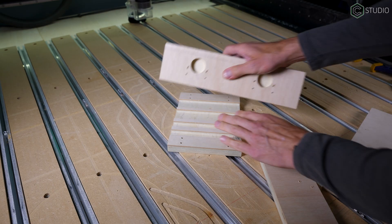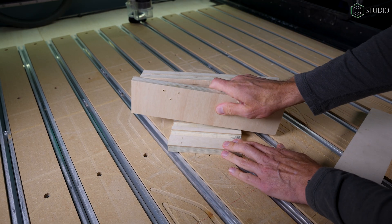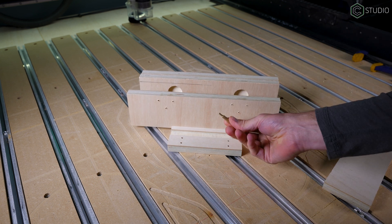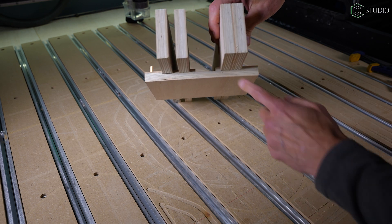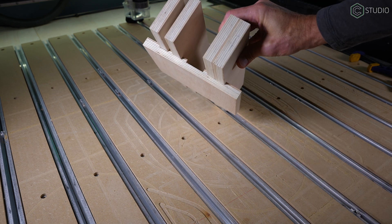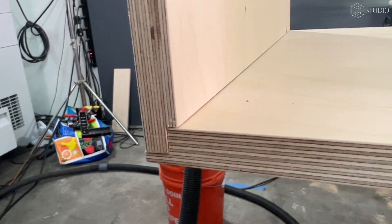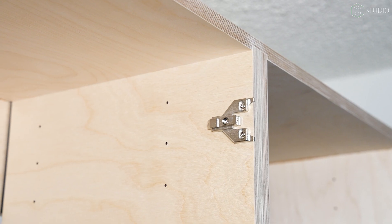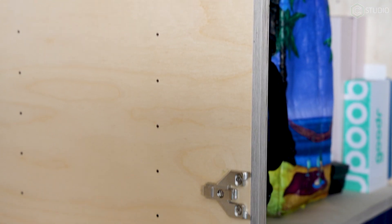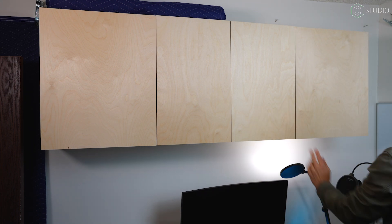Additional advice for version one: make a test rig. There's no need to waste a ton of wood — just worry about testing the interfaces of your design first. For this one, I thought about my dividers, putting them on a quarter-inch inset to provide stability and exact placement. I had to consider how my ends would interface with the bottoms and tops to form the overall box. I also had to figure out how to pre-position the clips as well as the hinges, along with all the mounting holes, so that when I pull the piece out of the machine, assembly is a quick and simple process.